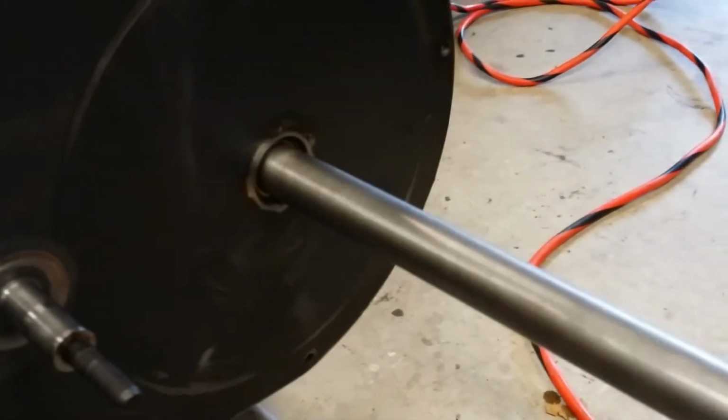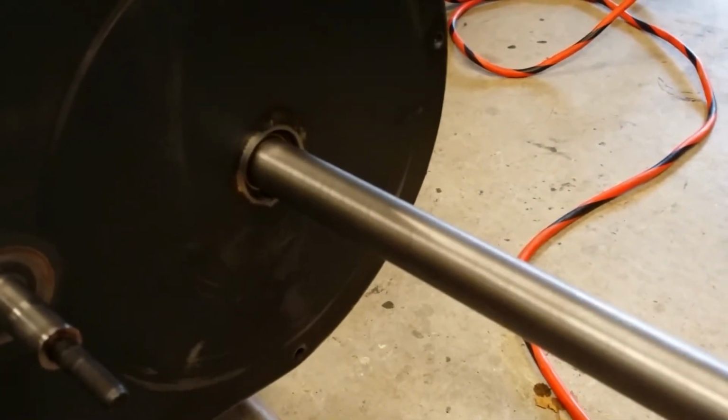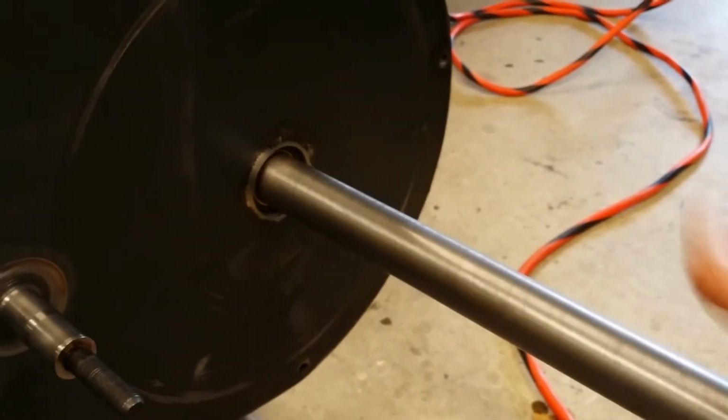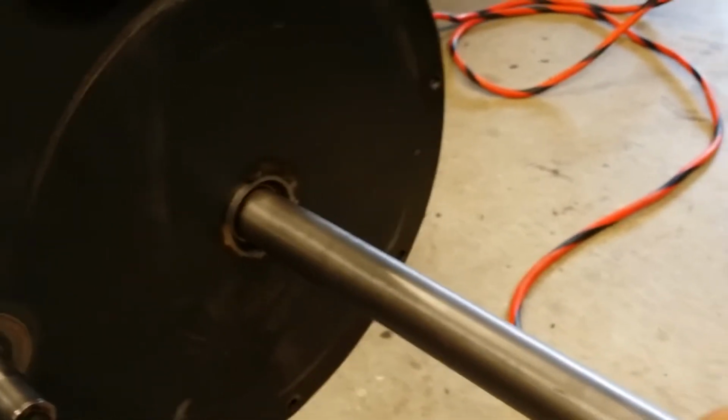You do want it a touch tight. It is just a touch tight. You can hear that when the bushing's dry. And for that reason, as you ride the tractor, it'll hone itself in. But essentially, just give it a little bit of a twist and a tug.